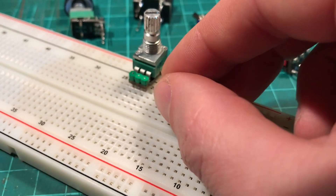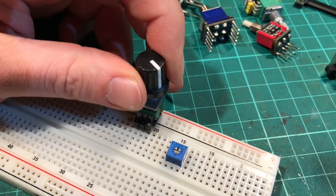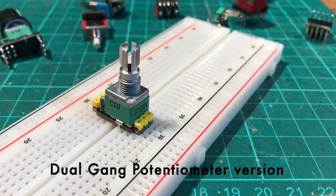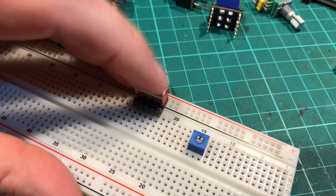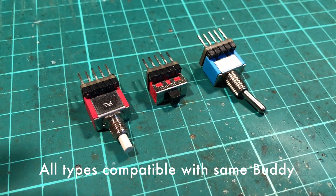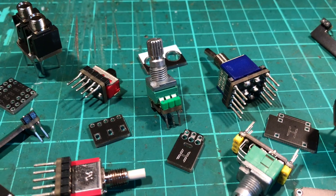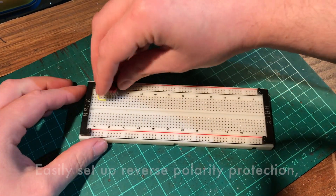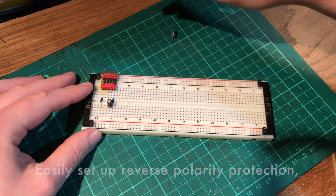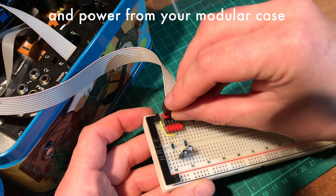You could substitute something else, but the actual components give you a real hands-on feel for your design interface. For example, a toggle switch, a push switch, or a slide switch can do exactly the same job, but each will suit a different situation. Breadboard Buddies let you work with the real-world tolerances you need to account for in your circuit and catch any nasty surprises specific to your components, like switch bouncing.